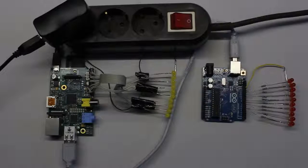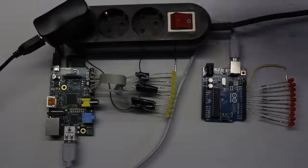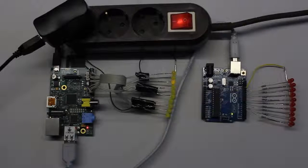The boot process is compared to that of a Raspberry Pi, which is running with a clock speed of 700MHz, which is approximately 40 times faster. A program controlling 10 LEDs is started as soon as possible, and, as you can see, the microcontroller is definitely the winner of the competition. The simple hardware design of the ATmega facilitates real-time processing of data. Hardware and software around the Arduino platform are open source, and the full description of the ATmega chip fits in a document with only 450 pages.